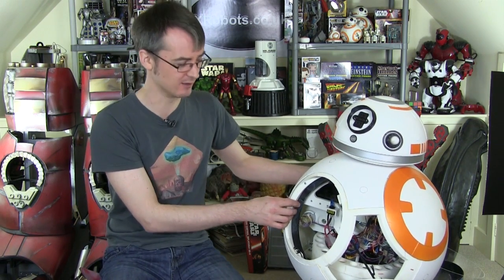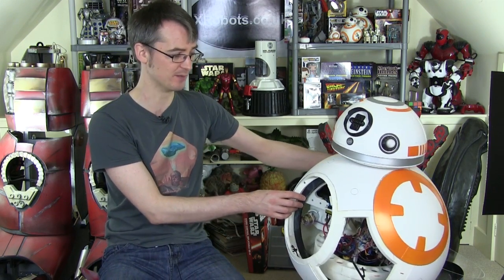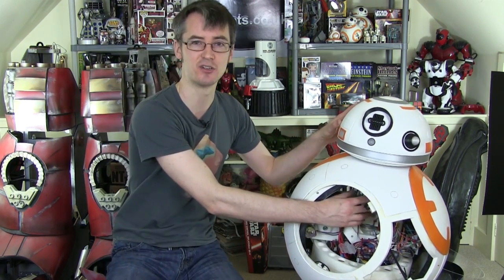Hello, it's James from xRobots.co.uk. This is part eight of my BB-8 version two build. Check back on the previous parts to see the complete build, the code, electronics, and I'm going to be releasing all the CAD and code once this is finished. Inside here we've basically got a hubless wheel which goes in one direction, and a big flywheel that spins to turn the robot in the opposite direction to the travel of the flywheel. The head is independently movable in all axes, and everything is controlled by PID loops and inertial measurement units that measure the angle. There's one of those on the head stick, or the head control arm, and one in the hub of the actual droid.